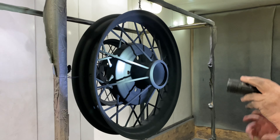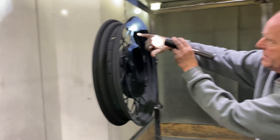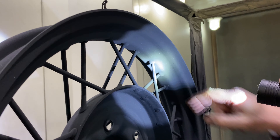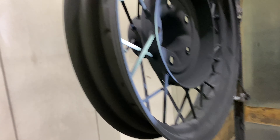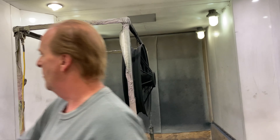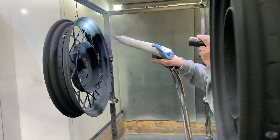I use the flashlight to look at all the spokes to make sure I don't have any light spots. See right here — a little bit of a light spot right in by that spoke. That's what I'm looking for: complete coverage. Because if we don't have it, that's a good spot for corrosion to set in. As soon as the corrosion starts, the powder curls and starts coming off in big flakes eventually. So we want to make sure we've got it all.